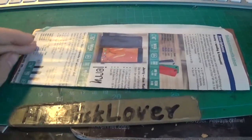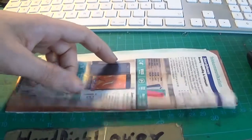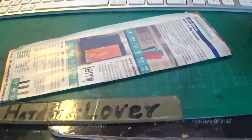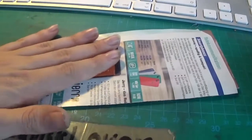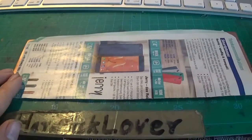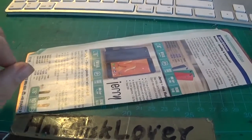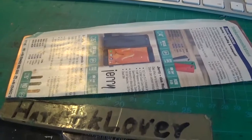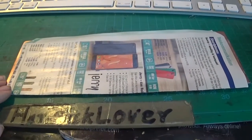So let's move everything there. As you can see, I have glued my paper — the one with the print on it — onto the copper plate. You have to watch out that this is actually mirrored, otherwise you will have a mirrored transfer and that would be bad. So what we've got to do now is iron this onto here. The paper I'm actually using is a catalog from Reichelt — that's a German electronics provider. The paper in their catalog actually has superb qualities for doing the toner transfer method — for transferring toner onto a PCB. I've done it multiple times before and it always works well.